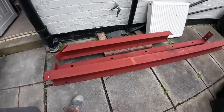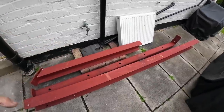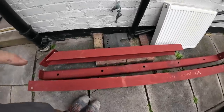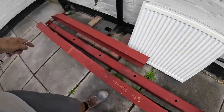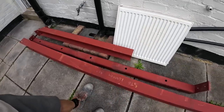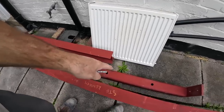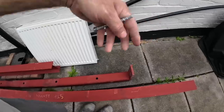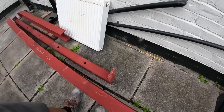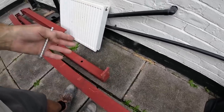And then, this is the one I'm nervous about, getting this one right. So we get the steel in position, get it bedded in and propped up with the acros. Then we're going to put this one in and we're going to hang it from this steel, bolted in, so it's suspended. And then we can mess around with it and get it in position, mark the pad stone, drill the pad stone. They can get this all drilled and fixed into position, then we'll put the pad stone in. I think we're going to use the epoxy we're going to use for these anchors to set the pad stone as well. And that might need building up a little bit, but better to have too much taken out than not enough.